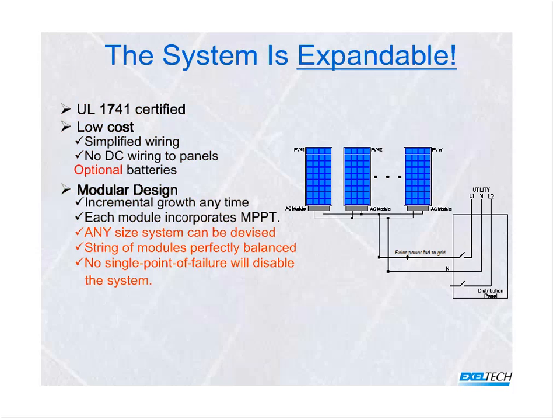Add several more. Somebody asked, well, gee, I've got 240 volts. Will they work in a 240-volt system? The answer is yes. Our inverters are 120-volt AC output. You can connect some from line 1 to neutral in a home or business, and others from line 2 to neutral, and you'll still maintain the balance the power company wants you to see.